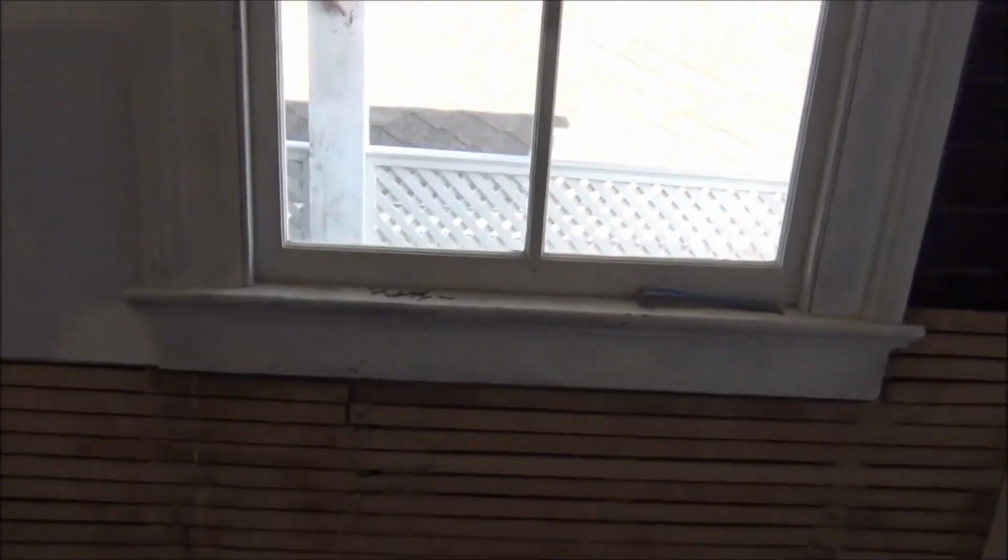Right up there, it's towards the attic. The hot water heater's in the attic, and what I'm thinking is I'm gonna bring the hot and cold and the gas line from the attic down this opening, whatever you want to call this right here. Bring it down and then plumb it from right up in here. I'm going to use PEX.